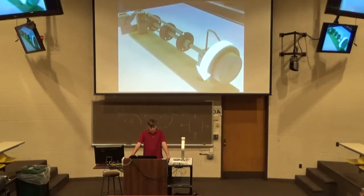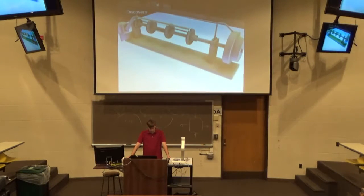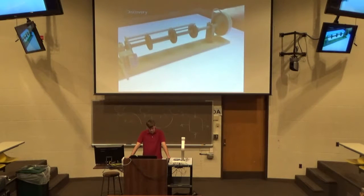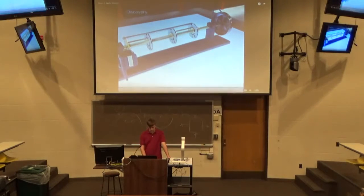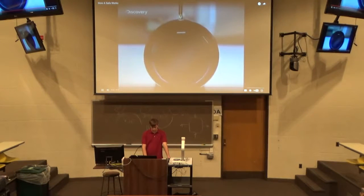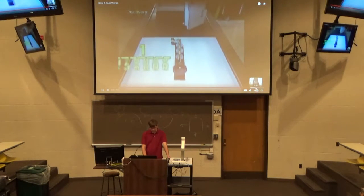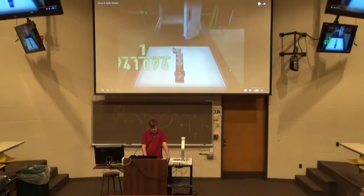To enter the third number of the combination, the direction of the dial is again reversed, until the notch of the third wheel is at the top, directly under the fence, which is finally free and clear. It drops into the notches, activating a lever which unlocks the handle. The safe now opens easily. The chances of randomly finding the one correct position for all three wheels are only 1 in 941,094.